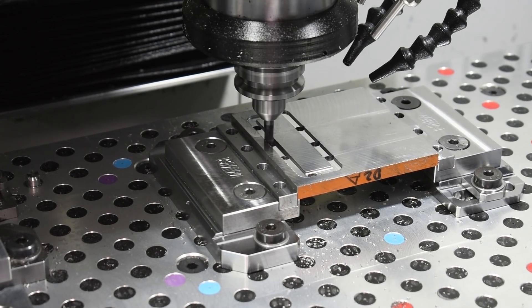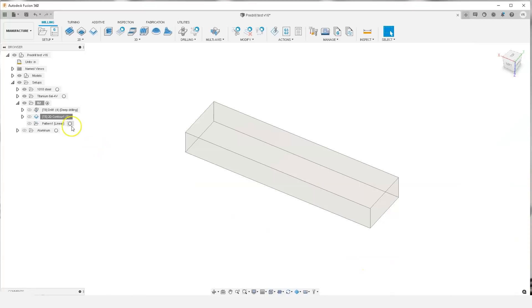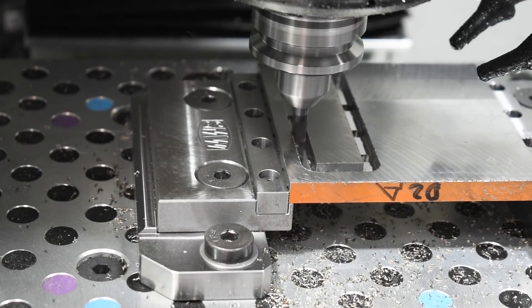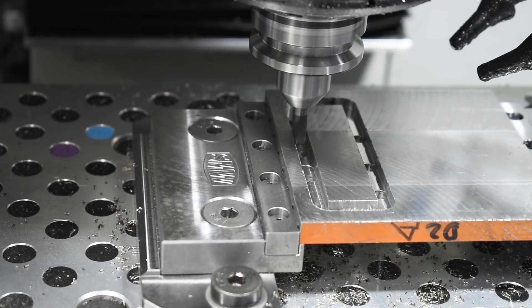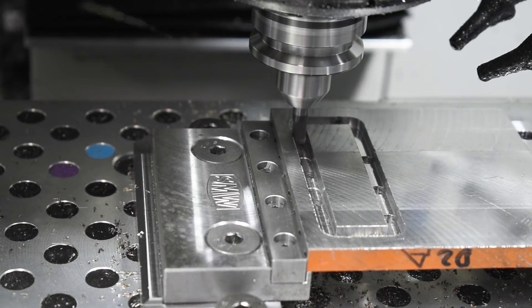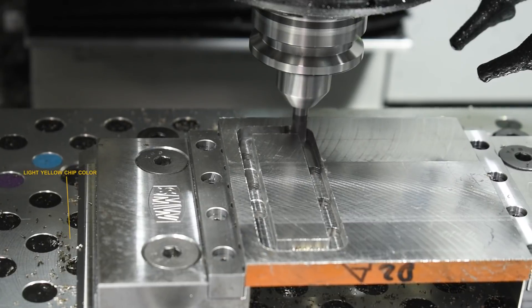To slot the part out and leave tabs I used the contour tool path, and the tool I used was a Lakeshore variable four-flute for steel with a 15 thou radius. This tool is a pretty good do-it-all end mill and the corner radius means you're not going to chip out that flute, so I like using radius corners especially when pushing a machine in a tough material. The slotting depth was 30 thou without a ramp, so I used multiple depths and plunged into the pre-drilled hole. I may have been a little conservative with the chip load but for slotting I tend to half everything just to be on the safe side. Chips coming off were nice and straw colored — I didn't get into the blues or purples — and the machine sounded pretty nice and smooth, so I left it.